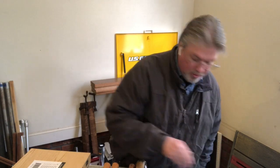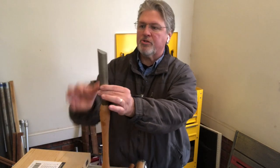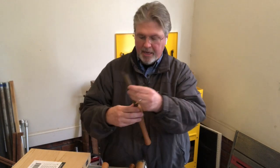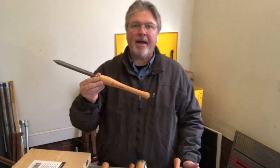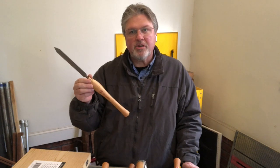So if you have no other tools at all, that least expensive set from Harbor Freight is not a bad deal to just have something to play around with. But you're going to outgrow that pretty quickly — it gets old because you're sharpening constantly since they don't hold an edge, and you're going to want to move up to high-speed steel. My favorite high-speed steel tools are made in England, manufactured by Robert Sorby. Here is an oval skew — it's that skew-shaped chisel but the body has been ground into an oval, which makes it slide and rotate easier. You can see on it, faintly, it says Shopsmith. This parting tool also says Shopsmith. Shopsmith back in the late 90s and early 2000s had Sorby private-label some high-speed steel tools for them.